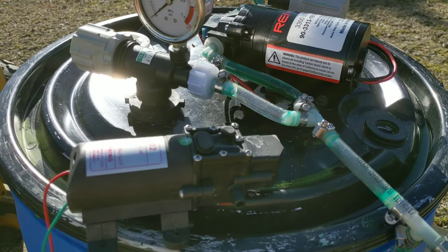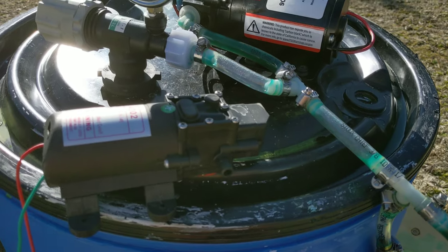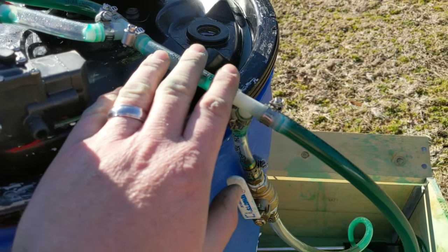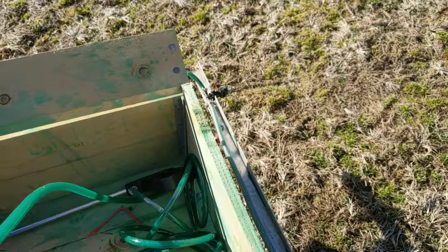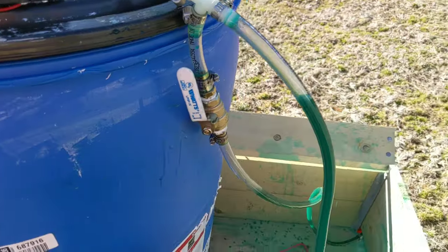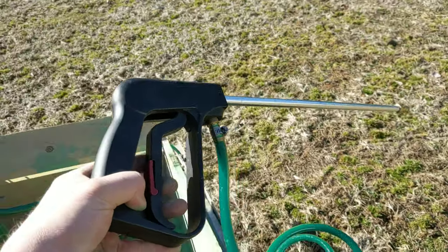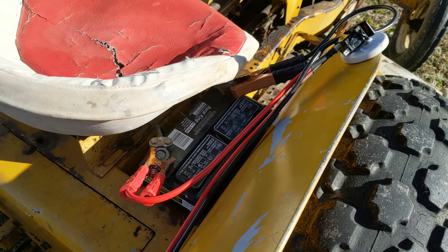The other thing I wanted to do is there are some areas where the trailer just isn't going to reach and I want to spray around some bushes and things — some pre-emergent or even weed killer. I wanted a wand. There is a tee coming off the pressure point and normally it just goes right down into the corner and goes to the wands on the back side of the cart, but I wanted a separate wand so I can flip this valve right here and then use this particular wand to get into flower beds and areas where I need to spray pre-emergent or herbicide.